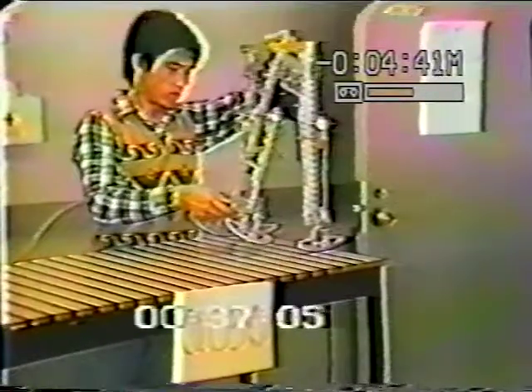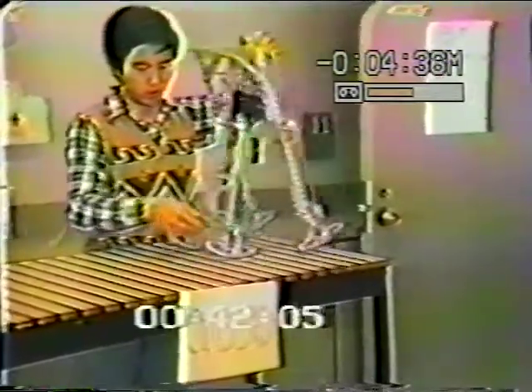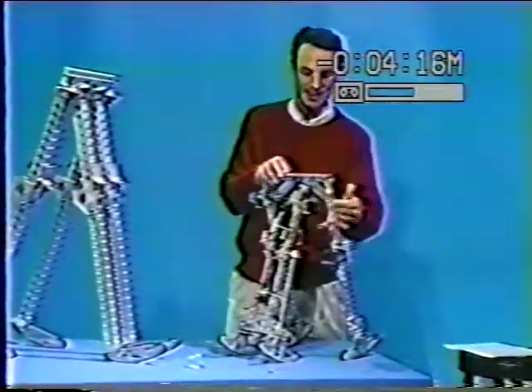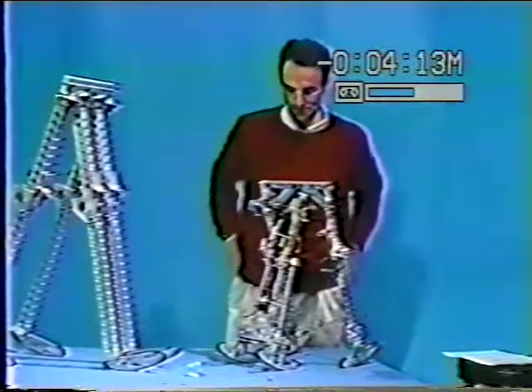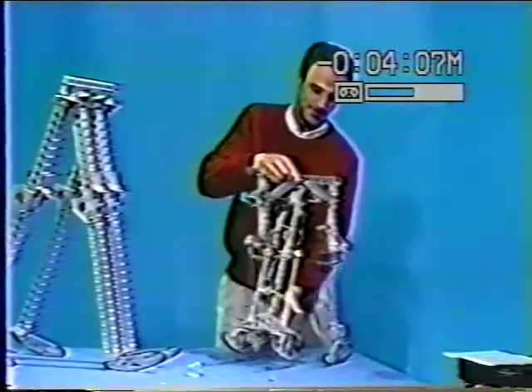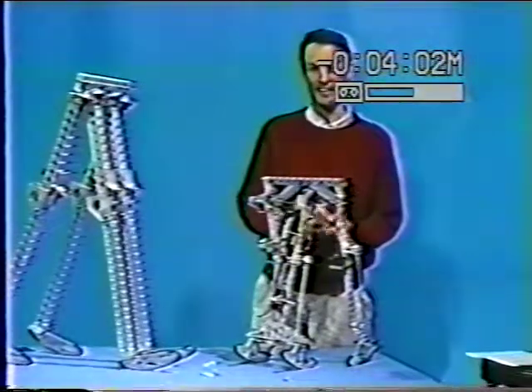And now the slope is three percent. Now that you've seen what this machine does, it might strike you that some features are out of proportion. The grand problem of generating the gait is solved by just two straight legs, a pin joint, and a downhill slope. However, the relatively small problem of foot scuffing requires addition of this elaborate, complicated electronic active mechanism.